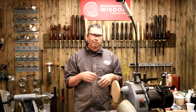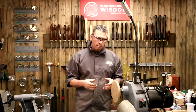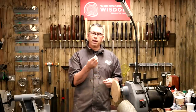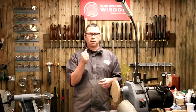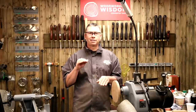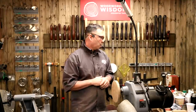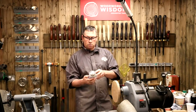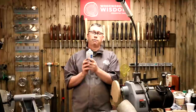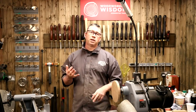In terms of food safe, now food safe is going to be used with wet foods, very, very similar thing to toy safe. However, you're going to be using wet oils or wet food safe oils, for instance, on salad bowls often. So if you do get a little bit of that ingested, again, it has to be absolutely safe for you. In terms of a hard finish and still being food safe, I would struggle with that, I'll be honest, because my first instance would be to go with a lacquer. Now, I know the cans of acrylic gloss lacquer do state toy safe. They don't state food safe. So I think you'd have to contact the manufacturer just to discuss that if you wanted it to be food safe.